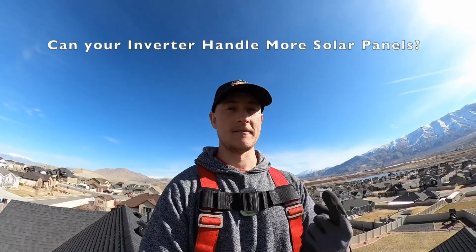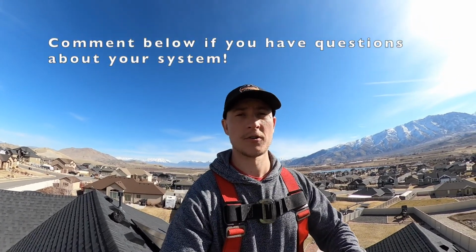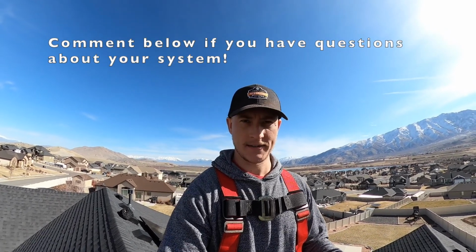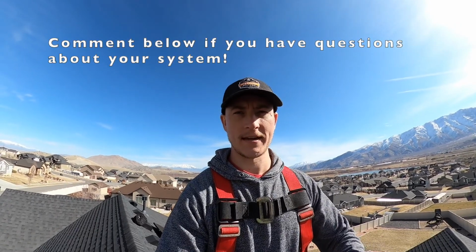So the first two things that you want to consider: can your inverter handle more solar panels? Does your roof have more space for solar panels? Most solar panel systems, whether you have micro inverters or string inverters or DC optimizers, have design constraints where you can only put so many panels on a circuit, or you can only backfeed so much power into your main panel.